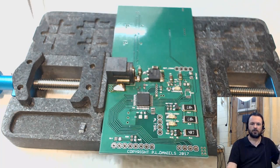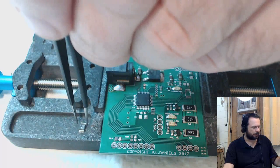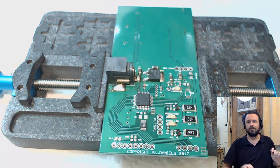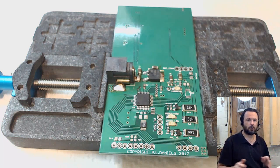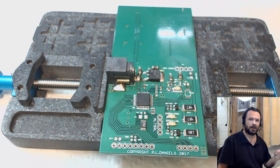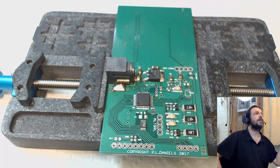So that's why we use the Coulomb counter or the milliamp hour counter. So you can say, okay, we've used up 80% of what we should have in the pack. Probably time to start landing the plane or the helicopter. I mean, to be fair, planes and helicopters always land, no matter what happens. They will land. The question is, will they land in one piece? So that's what that was all designed for originally.